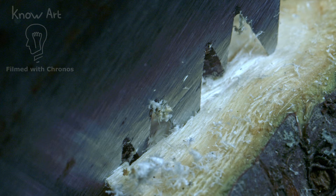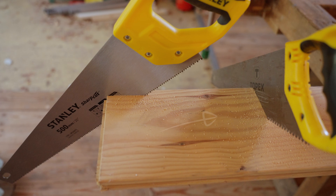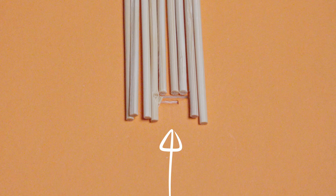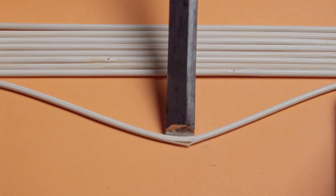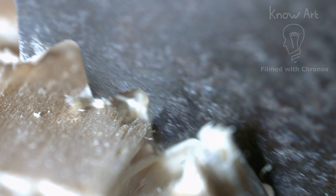The two most common types of saw blades by far are rip cut and cross cut saws. A ripping saw is just a bunch of straight chisels after one another, made to saw along the grain of the wood — it chops off the fibers, and since they are only weakly connected on the sides, it cuts great. In the other direction it works too, however not very well, because it makes a super easy cut between the fibers, but then it has to tear them, causing the fibers to splinter outwards on the ends.